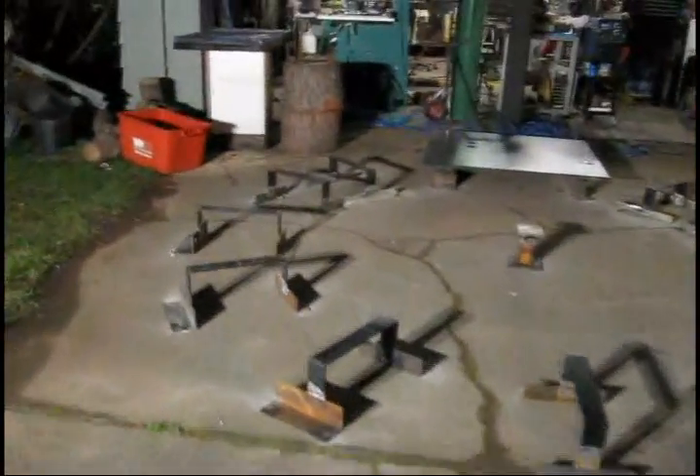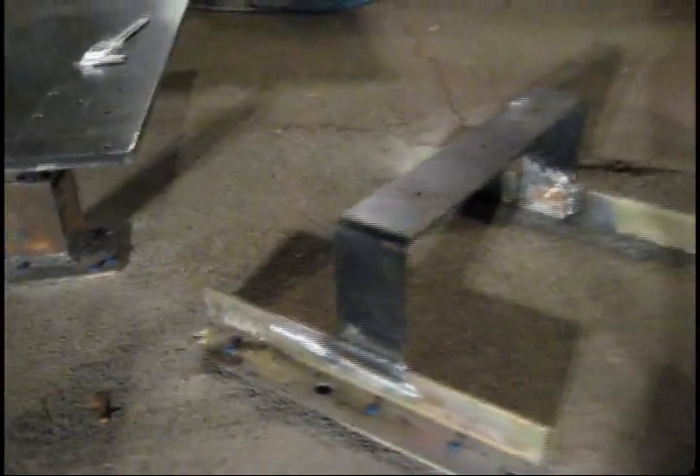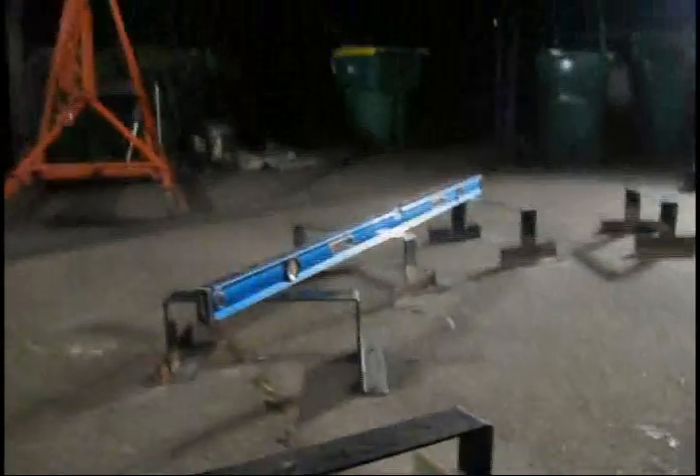Now I have all the brackets leveled in. They're all measured across from the center hub to the support bracket — angle iron screwed in, leveled, and then welded into place. Now because they're all measured off this center point, they should all be fairly accurate with each other. The real test is how accurate they are amongst themselves now that everything's done.